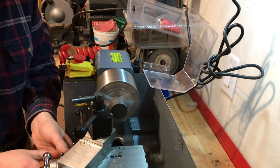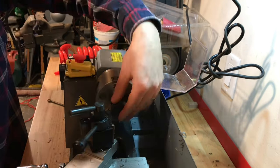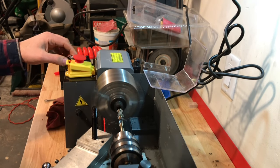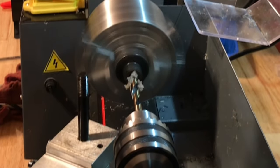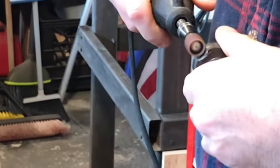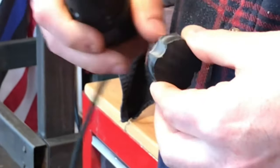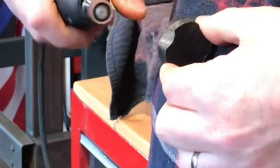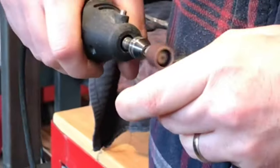Then I re-chucked it with the handle side facing out, and I had to bring down the diameter on that. As you can see there, it made pretty quick work of it. You do have to stop it and just clean it off so you can see what you're doing. And then here I'm chucking it up and drilling a hole so it'll slide onto that threaded screw. The nice finish it just leaves on the Delrin — I can't get over it. I went back and forth several times to get that right. And then here I'm putting some grooves in it so I have something on that knob to grab as I'm turning it — I'm using my Dremel tool and making four cuts in it. It seemed to come out okay, but what happens is the Delrin does heat up a lot, and it just wouldn't leave the same finish on the cut grooves as it left from when I did it with the lathe.